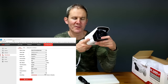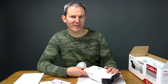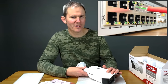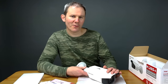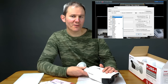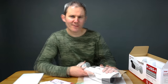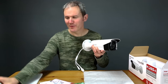The 12 millimeter lens projects images onto a 1/2.5-inch CMOS sensor, capturing images at 20 frames per second at 8 megapixels or 4K. This camera works great with Hikvision NVRs — simply plug it in and no further action is required. It's also ONVIF compatible, meaning it works well with other ONVIF-compatible NVRs. Connecting it to Blue Iris is also a breeze since it's listed as a known device in the camera properties.